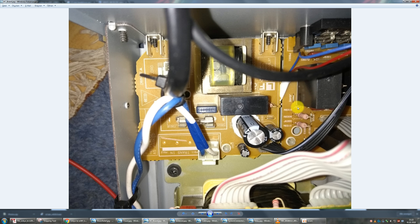In my case, since it was quite easy to get this board out, and for my purposes it was enough for the subwoofer to turn on whenever the amplifier is turned on, I just used this relay to also drive the system connector. So what I'm going to do is hack it so that whenever the user switches on the amplifier and this relay engages, the system connector is also powered and the subwoofer comes on. I'm going to show you how I did this.